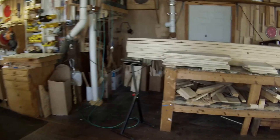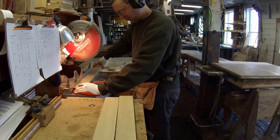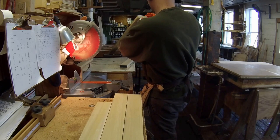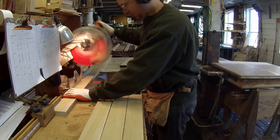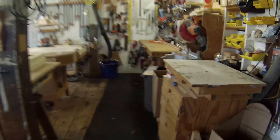At that point you can begin to really read the stability of each piece. Every time I would cut a piece on the chop saw, I would test it to see how flat it sits on the table. The quality control step occurs when this wood is being processed on the chop saw and then again on the jointer when I flatten the boards, because I want to select the boards that have the least amount of twist in them already.